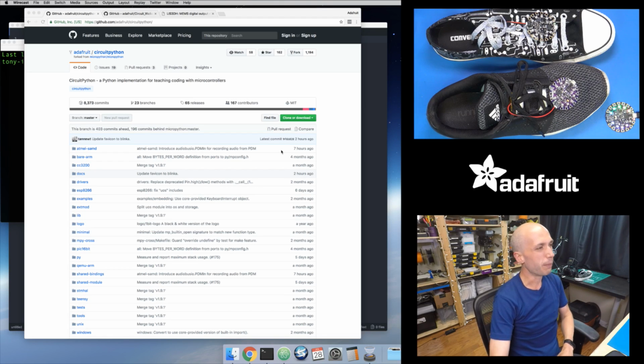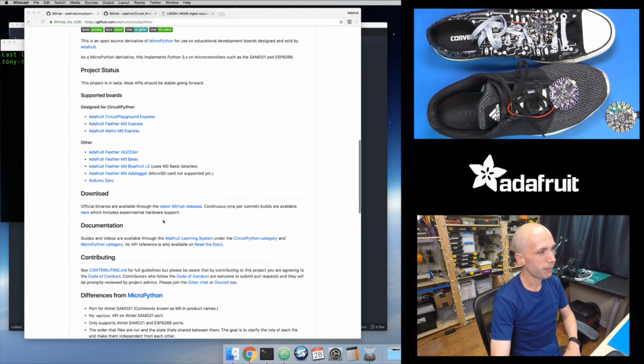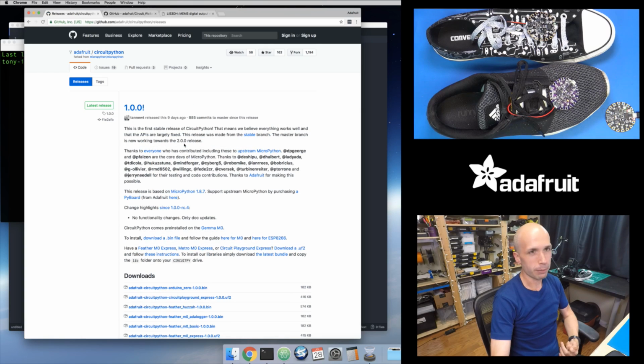But I need to load CircuitPython, and the way to do that is you go to the CircuitPython repository. This is kind of the main homepage of CircuitPython. It has links to all the documentation and things inside of it. But to load it onto your board, on your Circuit Playground Express specifically, go to the Releases tab up here. And then from the Releases tab, find the latest release. Like the 1.0 release is the latest one for here.